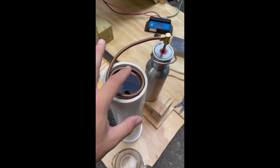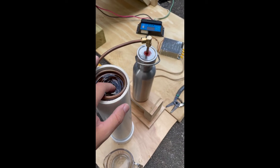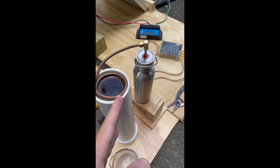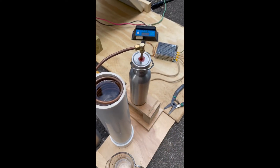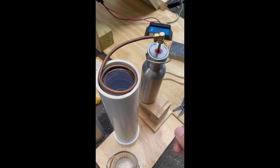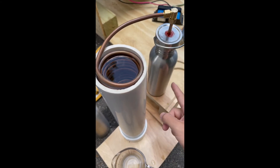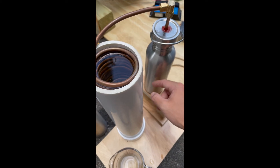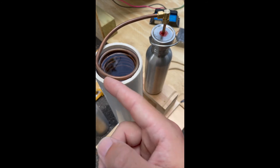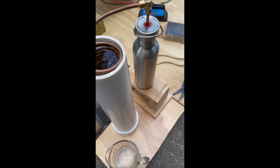Also, this coil gets incredibly hot — so hot that the steam heats the water in the distiller almost to boiling. In a real application you'd exchange that nearly-boiling water into the heating element vessel so it turns into steam more efficiently, then fresh contaminated salt water would refill the distiller, creating a cyclic loop.